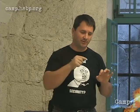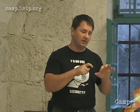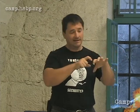So with a Chinese lock, you apply a tension to the plug to turn it in the opening direction, and you put a pick tool into the lock, and you see the pins. Then you can always find one pin which is binding. Then you push that pin, comes a big click, click. Then the second click, third click, fourth click, fifth, open. So that is a Chinese lock.